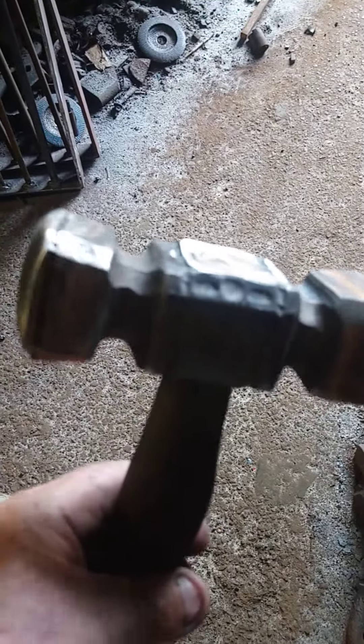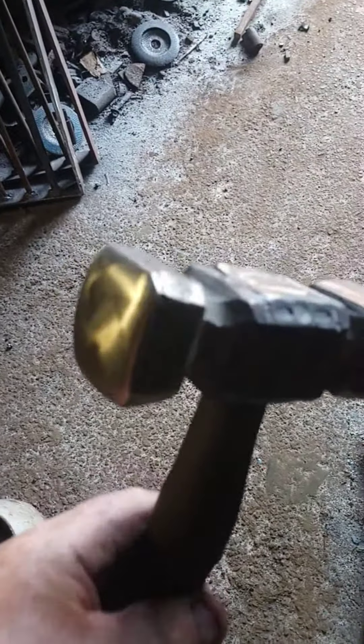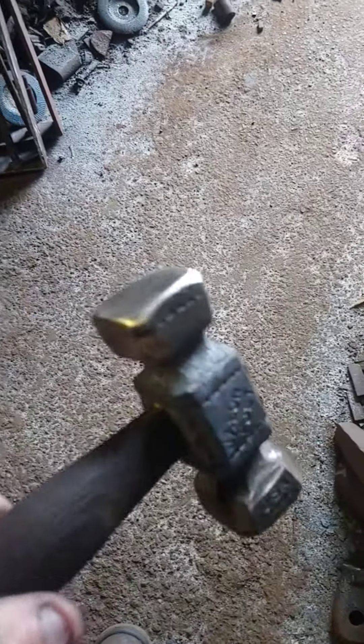They start running from each end to the heads on each side. The color to be looking for is like a brassy color — a gold leaf straw color. That's when you dip it. So that's a three-pound square shape hammer.